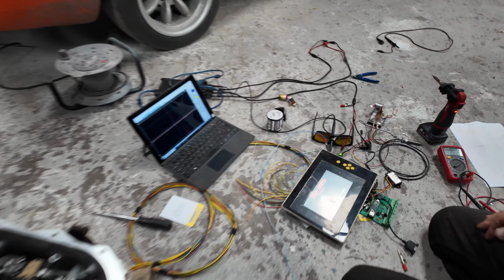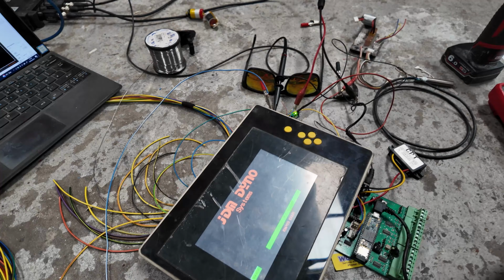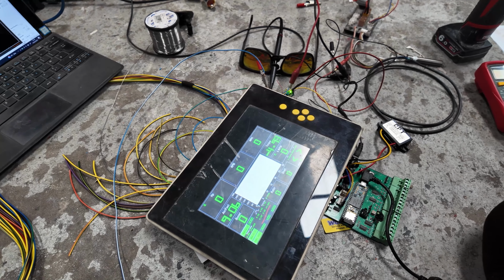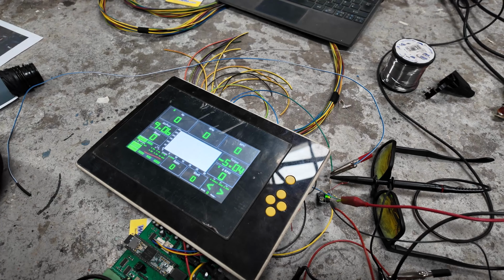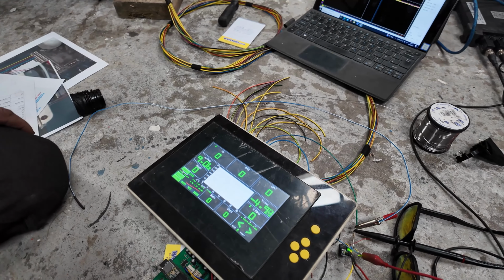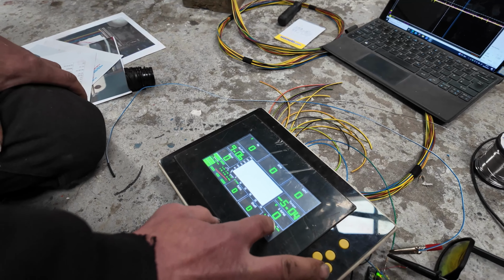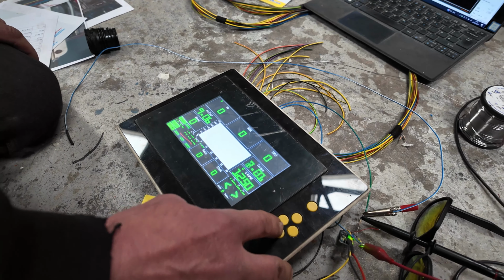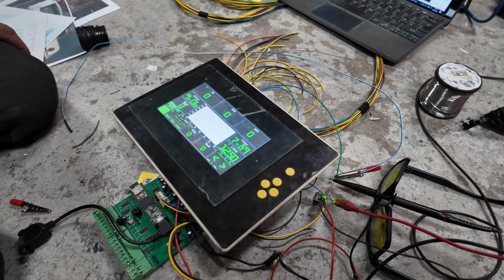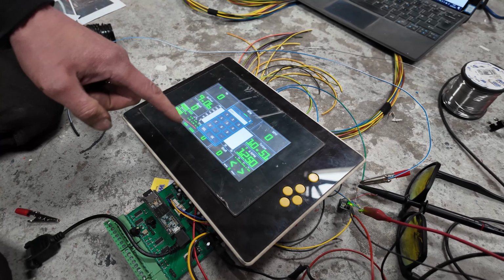Right, now you've just said you were going to use, what the hell is this thing? This is a DYNO controller I designed a long time ago. Let's come over here, that's better. What is this? You've made this? Yeah, I made this a few years ago, so it'll read RPM from the roller speed and hold a set RPM that you want it to hold. You can change the set point from these buttons, so see the set point changing there, or you can do it from here. What's this? That's just a case I made for it originally.